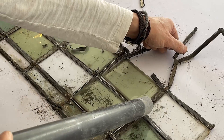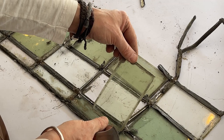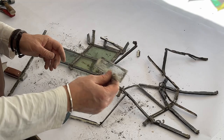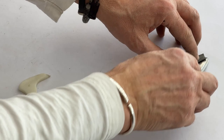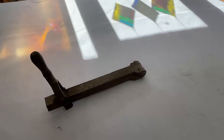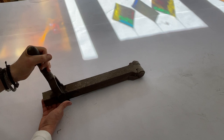Always keep a clean bench. Be careful with lead dust because especially Victorian windows were often made with lead oxide — red lead — and that is not good for you. There I've now removed the inscription glass very carefully and put it into place, so we know it's safe. We can continue carefully dismantling the rest of the window. Generally speaking, we recycle the lead — we save it and recycle it in due course. Interestingly, this is milled lead. We know it's milled because when you look at the heart of the lead, you can see small lines showing it's been milled — this is 18th century milled lead. The other method was cast lead, where molten lead is put into a clamp, closed to squash the molten lead into shape.